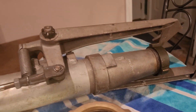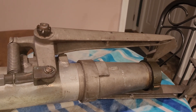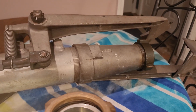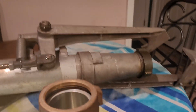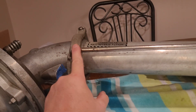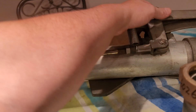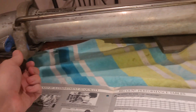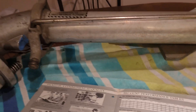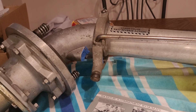I still see them out in Michigan — not very many around here but in Michigan I see them all over. With the price on a new SR 200 gun being about $4,000, farmers will use these until they break and can't be repaired anymore. The valley dealer I go to still repairs these, but it cannot be missing any of the cast-on parts. They cannot replace cast-on parts because they're not made by Nelson anymore. You can still get bearings, seals, gaskets, and bumper stops, but if the drive arm, reverse spoon, or cam broke, I would not be able to get those parts — the only way would be buying a broken gun and swapping them.